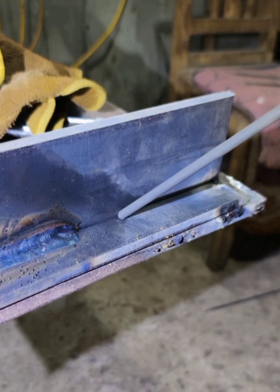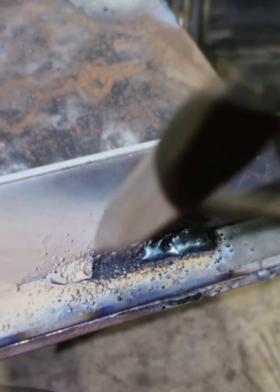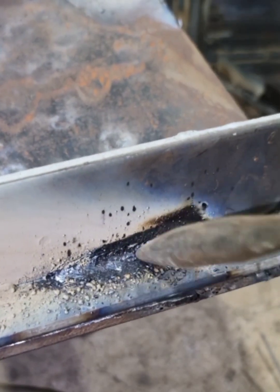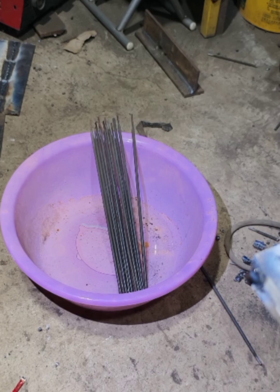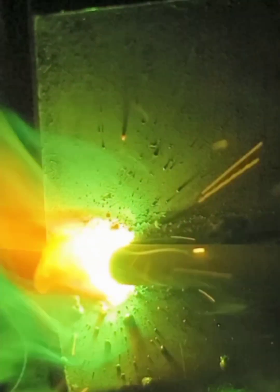The third defect is also the most troublesome for beginners: it is not easy to clean the flux coating after welding, and the weld surface color turns gray and black. The first cause is that operation is not skilled — the hands shake, making the electrode height unstable. If the electrode is too high, the weld temperature rises and the color turns black, making it hard to clean. The second cause is external environment and workpiece material — if the electrode is damp, air is particularly humid, or the workpiece surface has oil, rust, or other contamination, it will also cause weld discoloration and difficult cleanup.